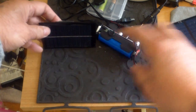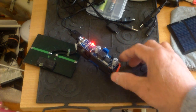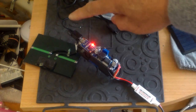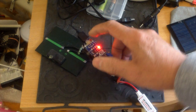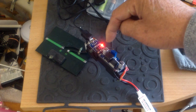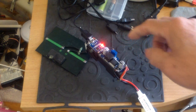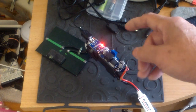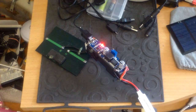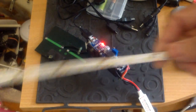I'm using a small solar panel — really small. I kind of doubt it will do the job, but you'll see what I'm trying to do. This is solar rechargeable and USB rechargeable with one single battery. When I plug it in it charges the battery, and when I unplug it the battery power goes through to this booster module, because the battery is only 3.7V — about 4.1V when charged — and I need to boost it to 12V.